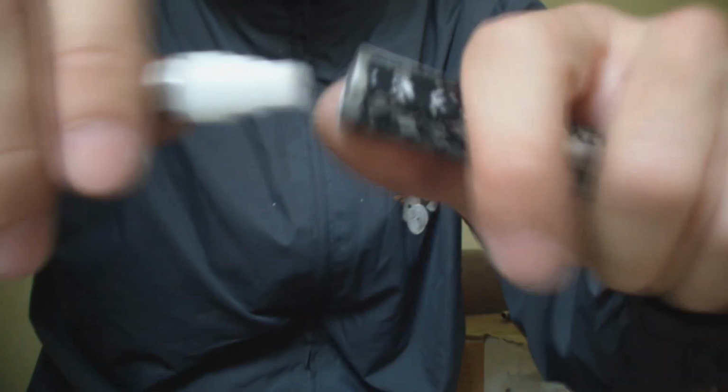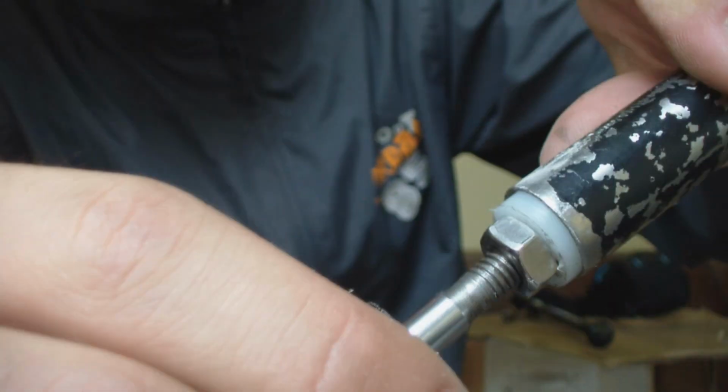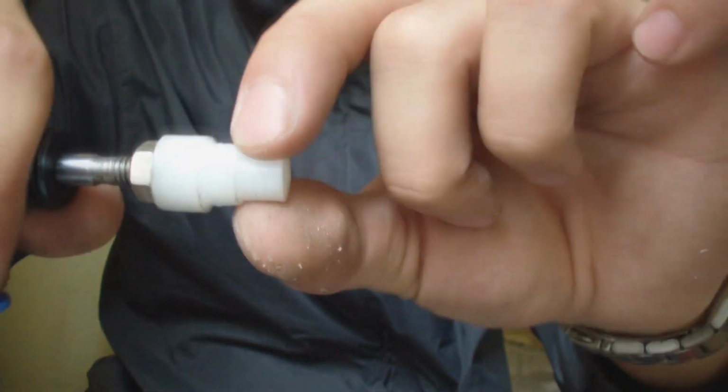Let's say the piston. It has to be shaped as a cylinder so it can fit inside the tube. A really tight fit. Not very tight, but as tight as possible. This will push the paintball, and the air that comes out from the QEV will sit here. So it has to be thinner at this end so the air has space to pass.